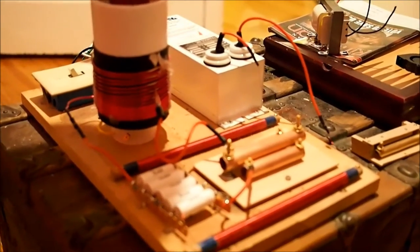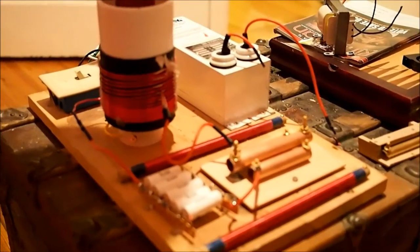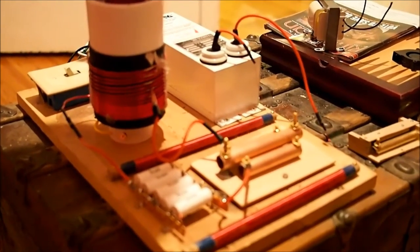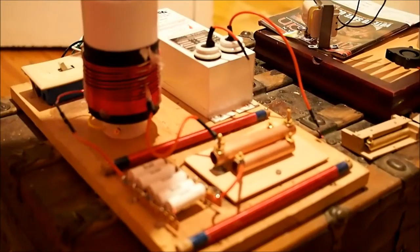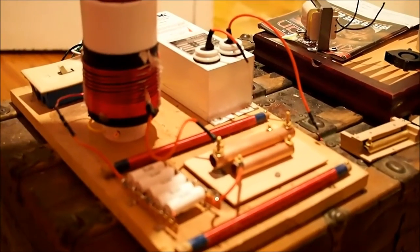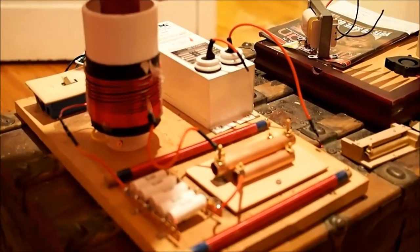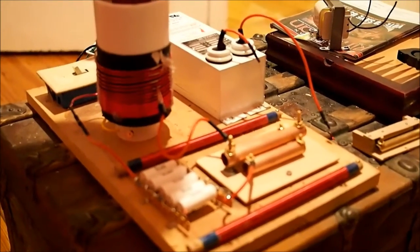for your eyes. And then we shield the capacitor bank because there is a risk of the capacitors exploding if the voltage gets too high or if something goes wrong. And we don't want something to fall in and short out the capacitor leads or any of that as well. So aside from shielding those two portions of the Tesla coil, I would consider this one complete.